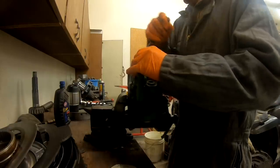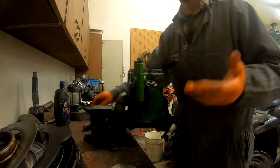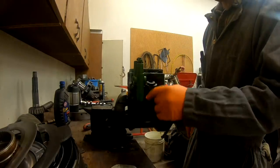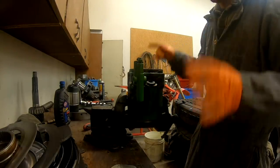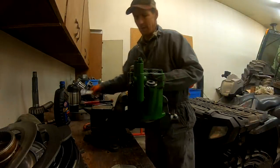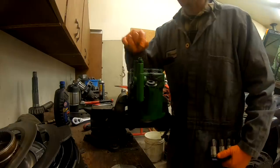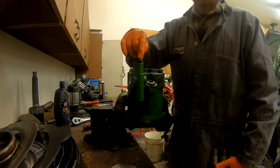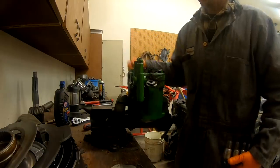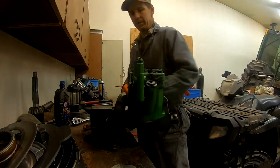You can adjust this when you put a new pump on — it's a good thing to check your system pressure. Don't just stick a new pump on and assume everything is good, because sometimes they're factory set on a bench. You need to check them on your actual tractor since every tractor is different. The first day I put the pump in I tried to adjust this flow regulator spool and couldn't get any action out of it at all — nothing would respond. That was because of that stuck poppet inside the inlet priority valve.